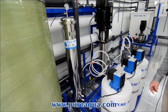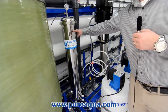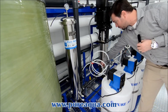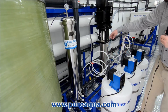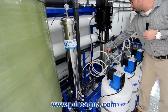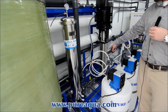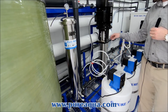After the water has gone through the multimedia filter, it is then on to a stainless steel filter cartridge housing for sediment removal. In line, we also have an ORP sensor for monitoring of the ORP in the water. After that, we have a low-pressure switch for pump protection. If the feed water goes down below 20 PSI, the low-pressure switch will shut down the system, protecting the system.